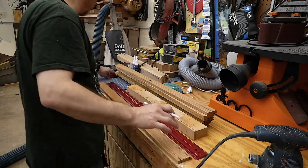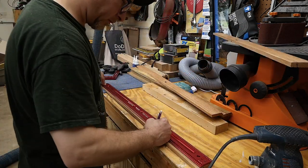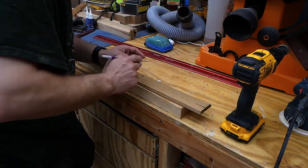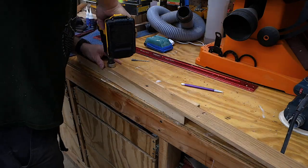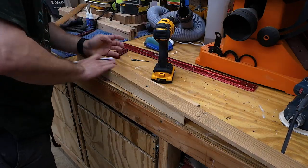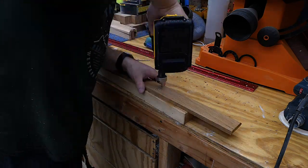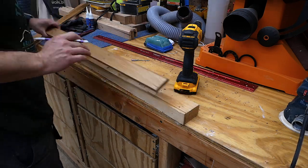After finishing the boards, I took them to the bench and marked out 2 lines 16 inches apart. I then pre-drilled countersunk holes for the screws that will hold the boards to the wall. Pro tip, I used the eraser to remove the pencil lines from the board. In doing so, I had very little cleanup once the boards were installed.